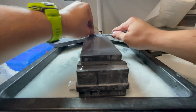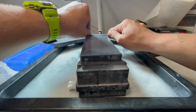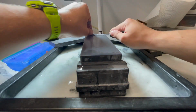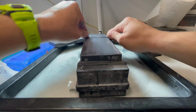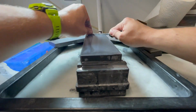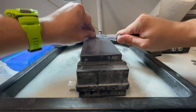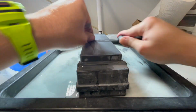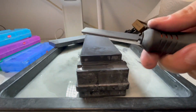And actually, it's starting to feel slicker. Remember when I drew that picture, I drew those big notches. Well, this finer stone is no longer scratching on the top of those little mountain peaks. It's getting flatter and flatter. It's taking those mountain peaks and turning them into plains, turning them into smooth, open pastures. And that's what we want. And so it's got a nice, smooth, fluid feel.